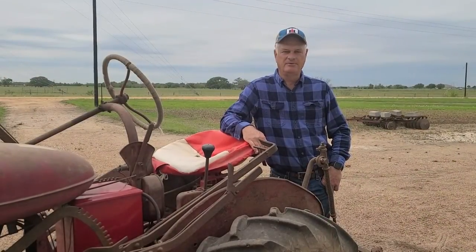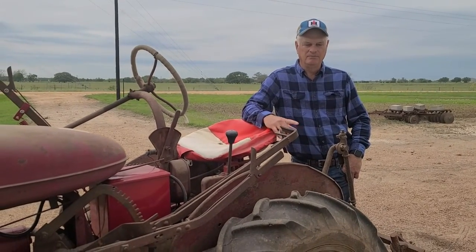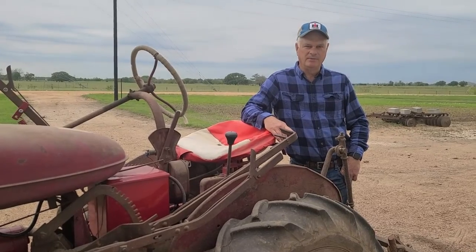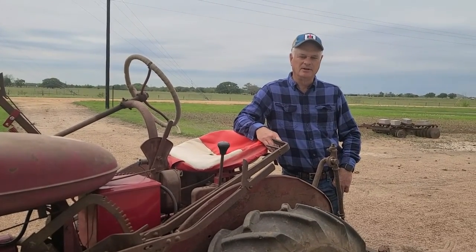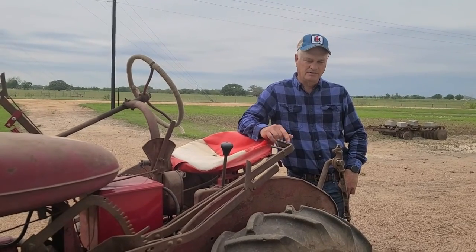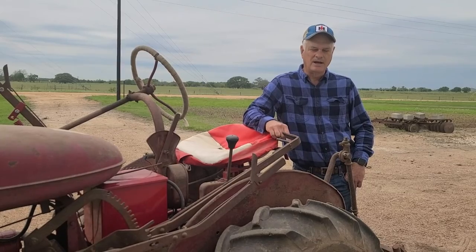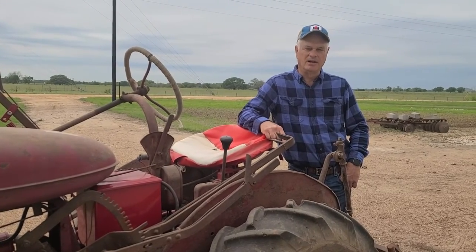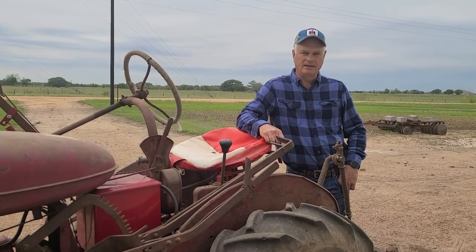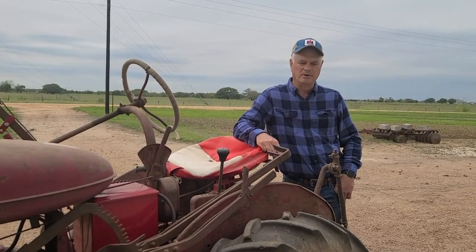Well, that does it for first time cultivating. Next video will probably be second cultivating. It's either going to be with a Lilliston rolling cultivator, or we'll come in with a 200 with a conventional cultivator like this with side dressing knives on it, and shoot a little more fertilizer to that corn. So that's the plan. Timing is just dependent on the weather and the growth of the corn and the milo.